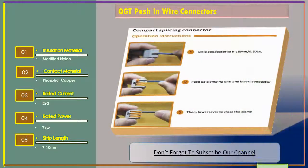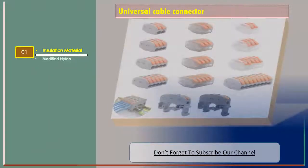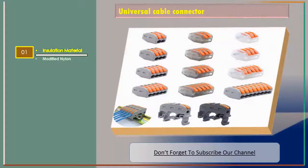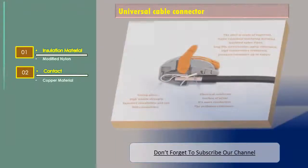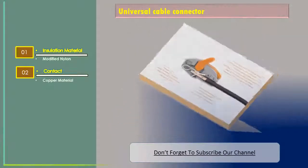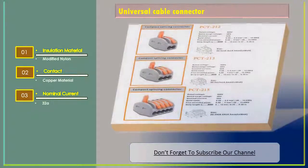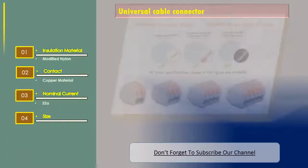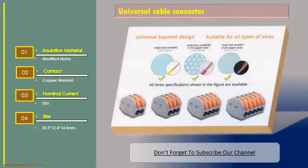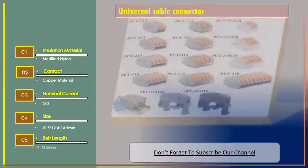Let's go for number 3. Universal cable connector, and the features are: insulation material, modified nylon. Contact material, copper. Nominal current, 32A. Size, 20.5 by 12.4 by 14.5 millimeters. Strip length, 9 to 10 millimeters.